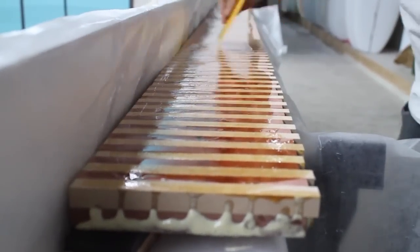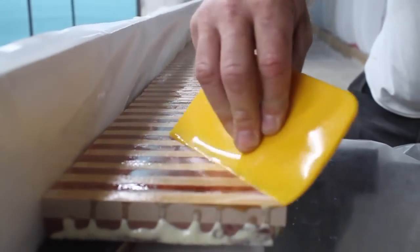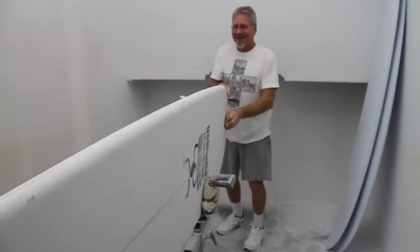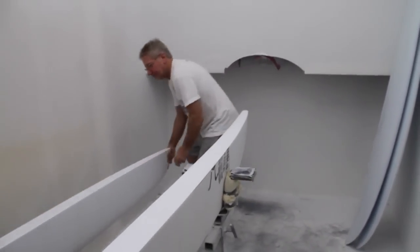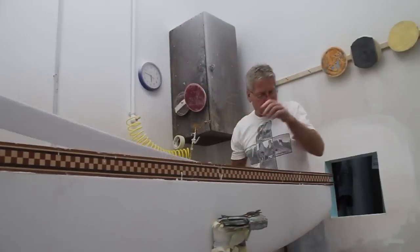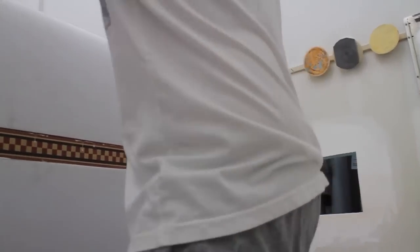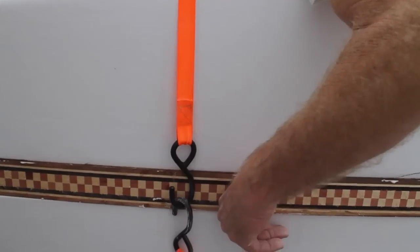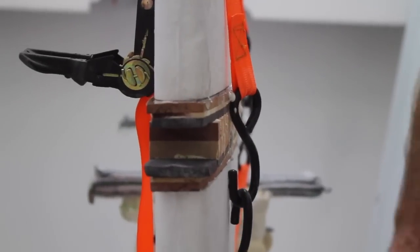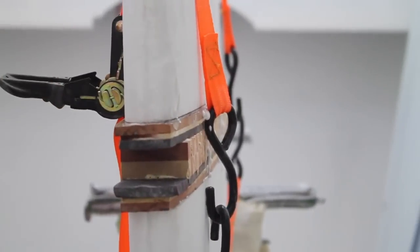The indexing was definitely the most difficult. I've glued tail blocks for years, and I glued it early in the morning — it was foggy that day, so there was a lot of moisture in the air. You put the glue on the wood and then spritz the blank itself with just a little bit of water and slap it together real tight, and just move really quick.